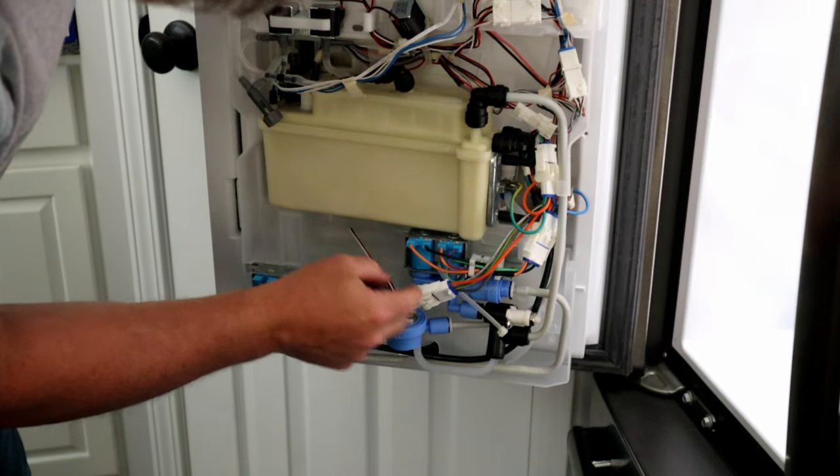This relay here should be controlling this valve, and that valve should control water through the flow meter here. So what we're going to do now is just disconnect the hose on the inlet water tank — that should just shoot water out of there. If it's truly coming through this valve, the relay is going to open, go through this flow meter, and come up this tube. This is the inlet to the tank and it should just shoot water out. And it does — so we know we're getting inlet water to our hot water tank.